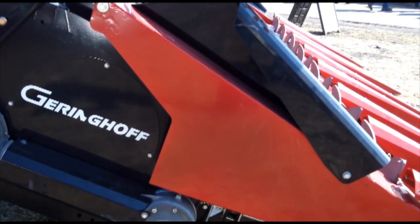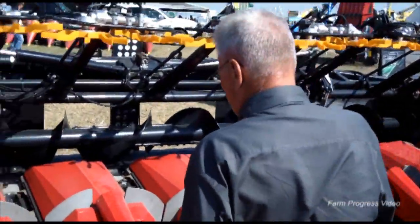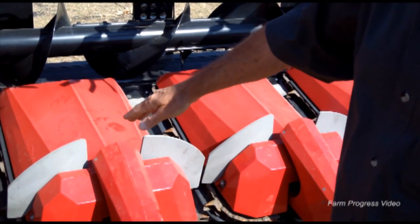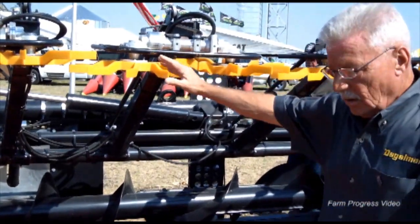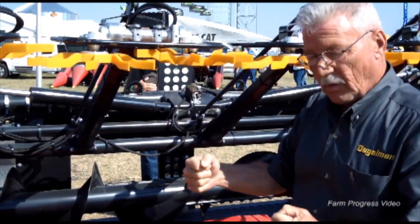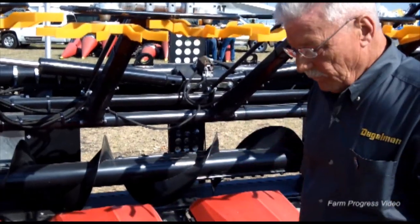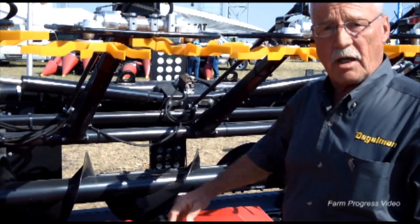And what's the secret? How does it accomplish that? The way the head is designed, it has rotating knives down here that will actually pull the stalks in and cut them off when it goes into the chopping unit. It also has gathering wheels up here that help grab the corn and gently bring it in and stabilize the corn so that we're not rattling the stalk. We're using approximately a 30 inch center right now, but we're able to bring the corn right into that 30 inch center, so we're only having to use eight units on this head to accomplish our goal.